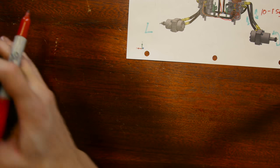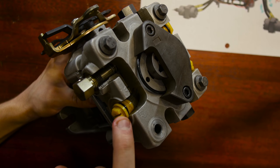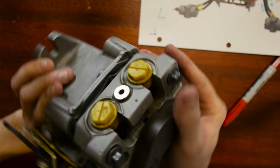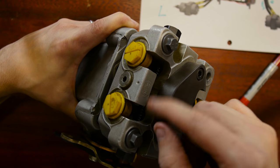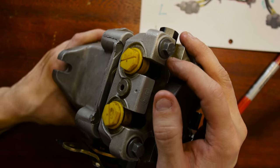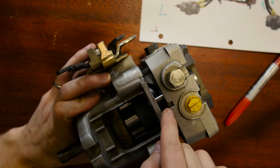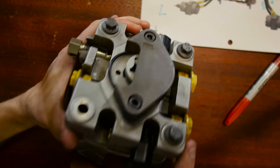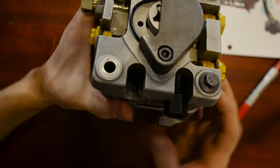Let's look at that second pump on the charge circuit. Oil from the tank comes in this rear port right here, flows up into the head where this gear — which is the pump — pumps charge oil. That charge oil goes into a center galley right here, and this center galley has check valves that lead into the main ports. Whichever is the lower pressure side, it lets some oil in. There's also a tiny bleed-by orifice where oil bleeds down into the case. A little lubricating oil also comes past these pistons and across the top of the head, all coming down into the case and returning to the tank through this port for cooling. It's very important that it's not pulling any air in, and that there's good flow for filtration.